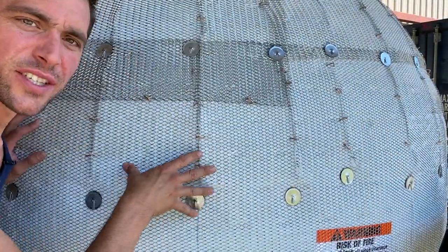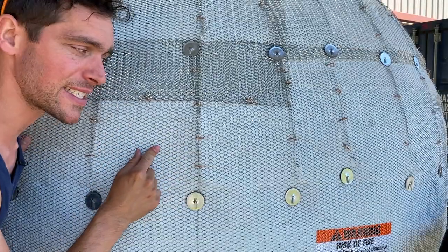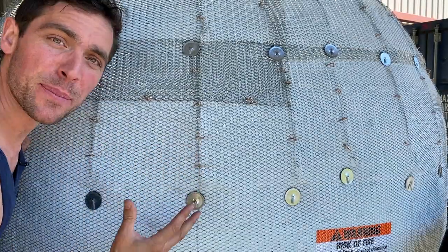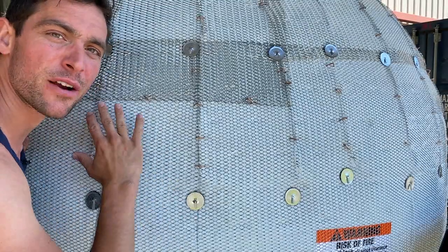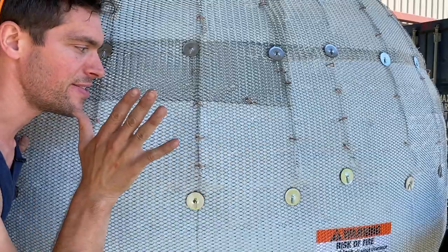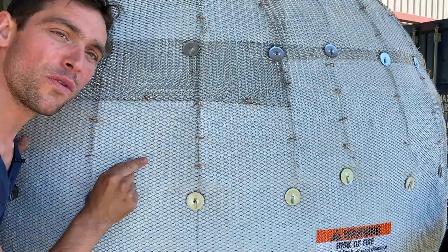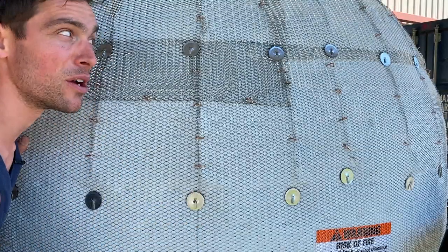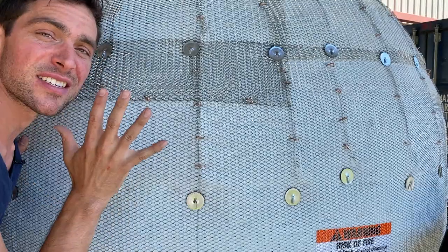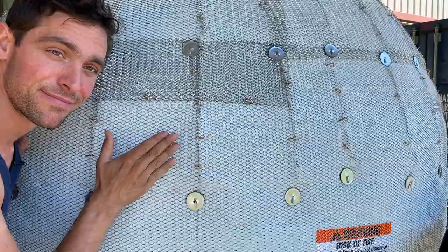As you can see, this is a very unique surface because it's actually a concrete base and formwork on the inside, which covers and encapsulates all of the heat. However, they put over an entire fabric system, and then with this framework, we have to actually tile over the surface. But first, we have to put a concrete underlayment over the entire thing to solidify this product. Then we can tile.